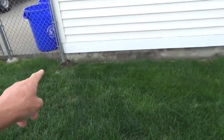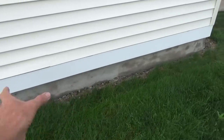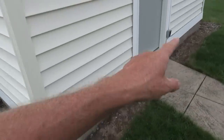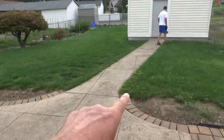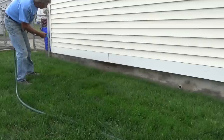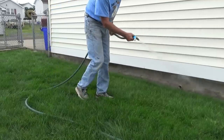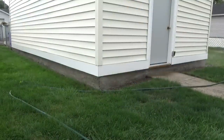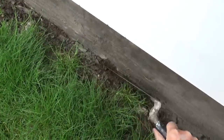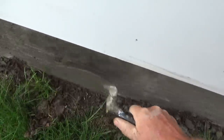We're back about a week later because we had other things to do. You see where the thick stuff went in — that dried a different color than the other stuff because it was all different sizes. All we're gonna do now is put on the final coat. Years ago I'd just splash it on for the customer, same thing — we're gonna do that here except in regular cement instead of white. First thing I'm gonna do before I mix my cement is wet it all down, I want this to be wet when I put my second course on. Before I put my second coat on I go around and chop the bottom, because I don't want the frost to get under there.